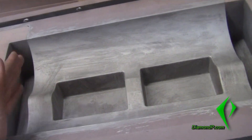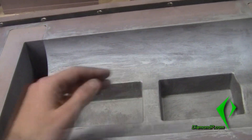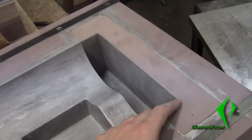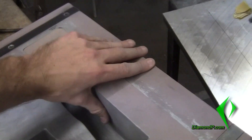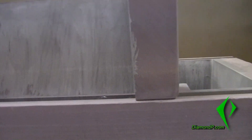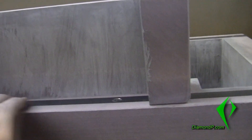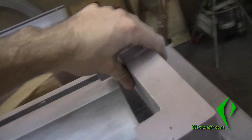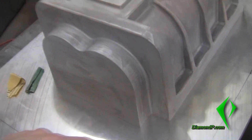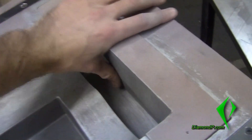That way when the molder sets the core down into the mold, he has a little bit of tolerance just in case he doesn't sit it quite right, and you don't want him to knock sand. I also want to take the time to explain how a loose piece of a core works. When this is filled with sand, as you can see on these loose pieces, this is actually a negative draft — it's angled this way instead of this way. So it's negative to the parting line of the core box. We had to do it this way because the center line of the bores has positive draft all the way down. So in order to get negative draft in the core, we had to make these loose pieces.